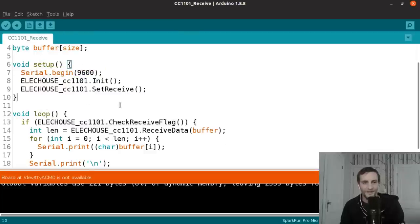I have to plug the Arduino in. Anyway, I'll be able to open up the serial monitor and actually see what this Arduino is printing out to that console. And that's why I've chosen to use visible characters on this one, so I can watch them stream in real time. Then you call that init method to initialize the connection to the wireless module.